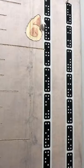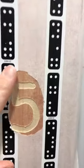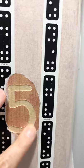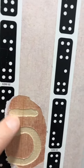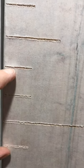Day two of this growth chart project, we were going last night, and finally it was just like, okay, then we need to get some sleep. So you can see that the Shaper Origin put grooves here in our board at our markings, and then we did the engrave for the numbers on the board. This is a router engrave, so I'll go through and just do a cleanup with some sandpaper on it, and we're going to stain the grooves that are in here with some black stain that I have.